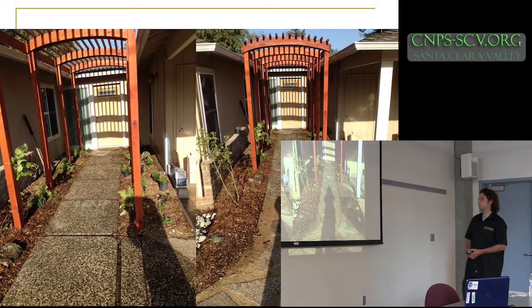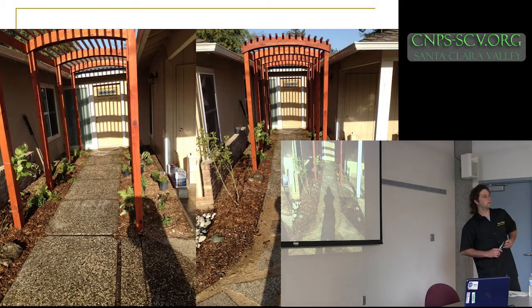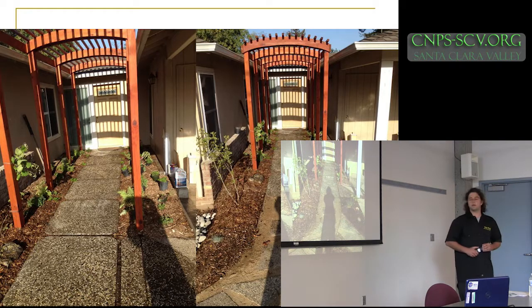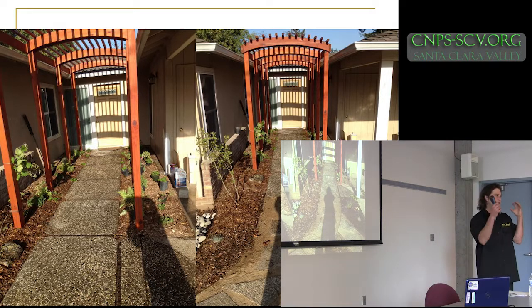So, is permeable concrete more expensive than regular concrete? Yes. Because not a lot of people do it. It doesn't take any more time or material to do it; it actually takes less material. Because it's a specialized technique and not everyone can do it, they just charge more for it. Permeable concrete is concrete with less water, so it creates almost natural air gaps in it. There's some more to it, but that's the basic of it.